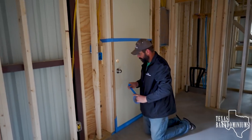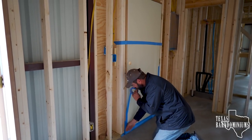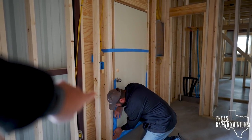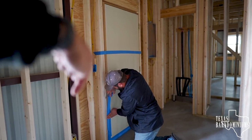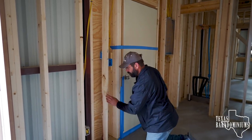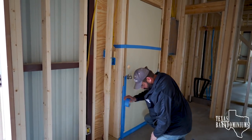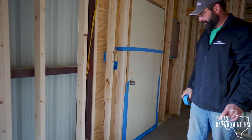The reason he's not covering up the door is these are temporary doors, so we don't worry about that too much. However, you need to make sure the jamb gets protected. You need to seal that gap between the jamb and the door, because when you go to spray close to that door, the stain will actually go right through that gap and stain your jamb. If it's paint grade, it really doesn't matter, but these are all stain grade, which pretty much ruins the entire jamb. Because once you stain it, you cannot get rid of it unless you have a darker stain.